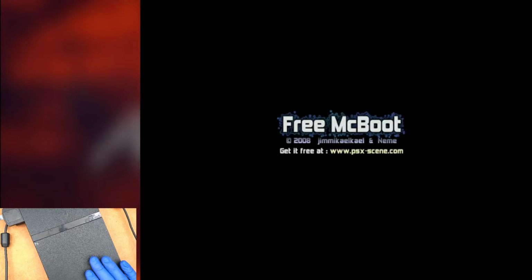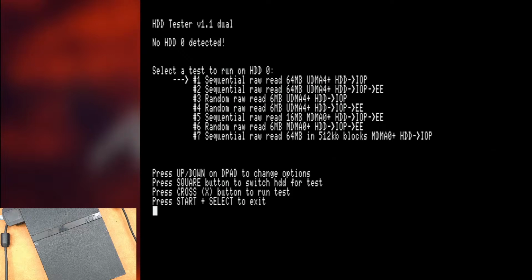Now, if we want to test the 1.5 terabyte drive, there are two strange things about it. First of all, and I think this is related to the hard drive driver modules in the PS2, for some reason, if it will detect it, you're going to see that this 1.5 terabyte drive is going to report as a 1 terabyte drive. And it didn't detect it.